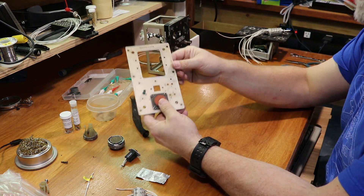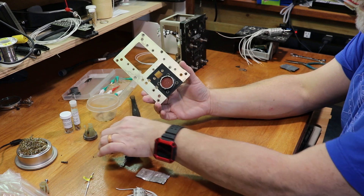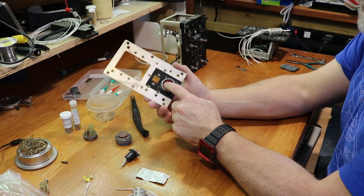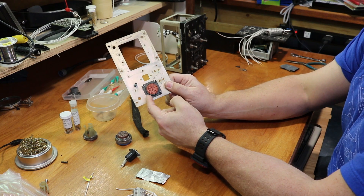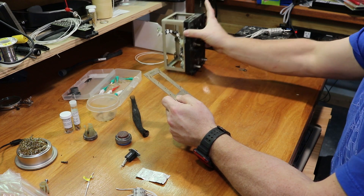This is the back side of the panel. This is the other cannon plug — the one that mates to the first. This one is all pins, whereas the other is all sockets. Same process: de-pin it so I can reuse it. These connectors are frighteningly expensive and really hard to get mates to if you're trying to match a specific connector.